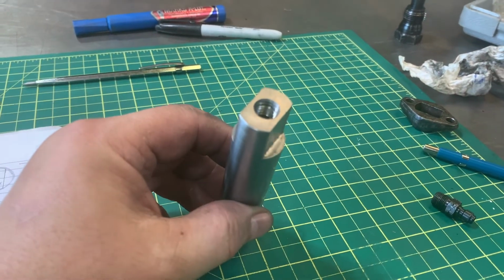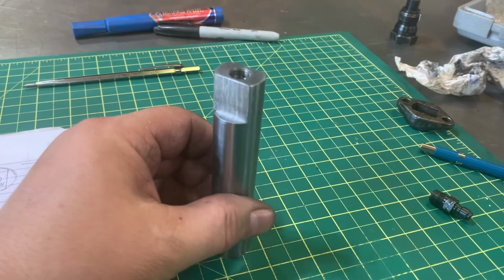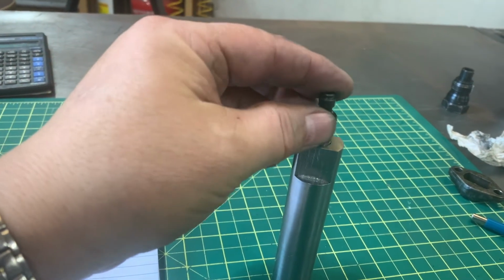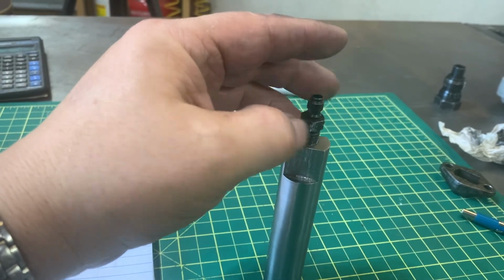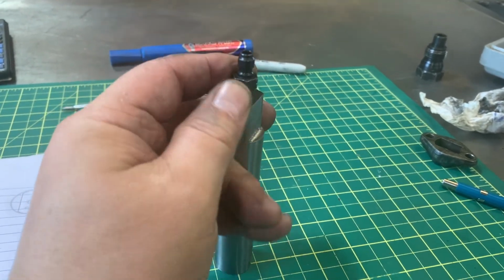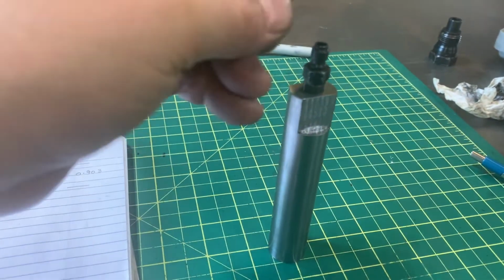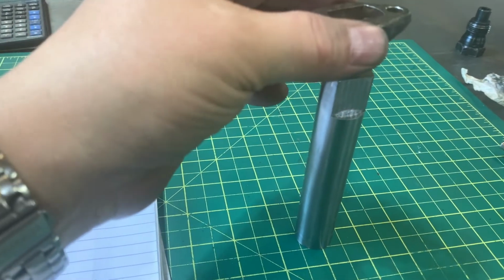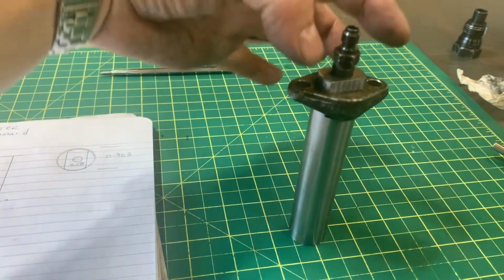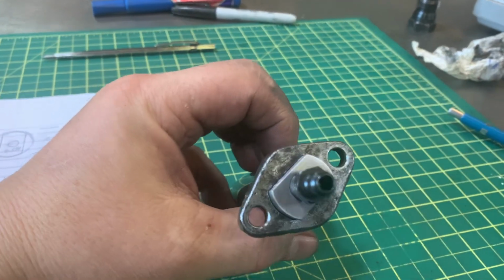This is an injector adapter, and all you do is take this valve here, put that in there, a little Teflon around, make sure there's no leak, and then the customer is going to take that, insert that into the orifice that it needs to go into, put that in here, and there's 2 bolts sticking up from the motor. He'll clamp that down and do his compression test from there.